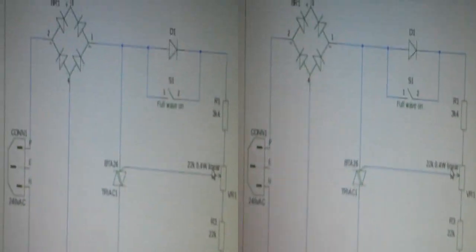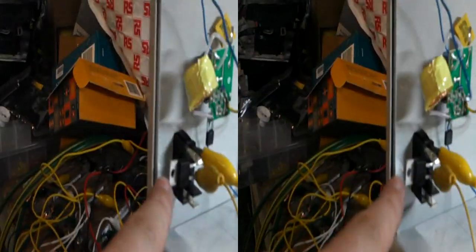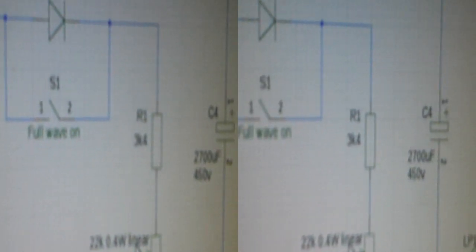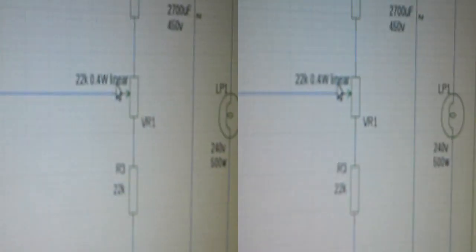The fuse is a plug's fuse. Diode with switch. And the top resistor is a 3.4K, which is this guy here — it's two 6.8Ks in parallel. And then we've got a variable potentiometer.